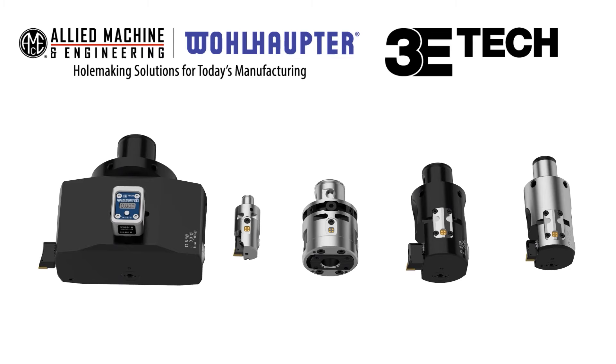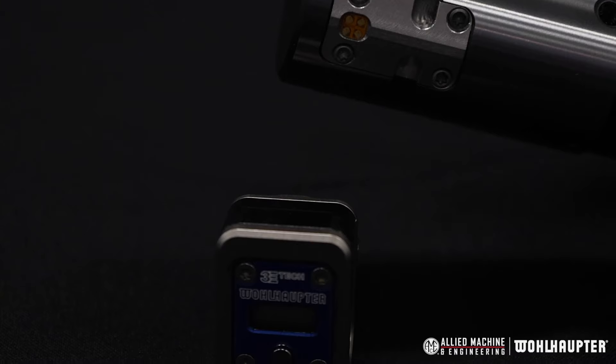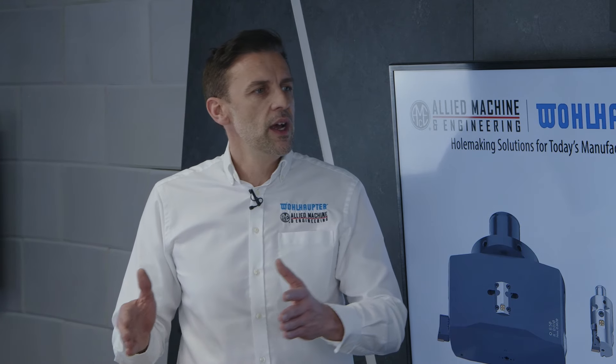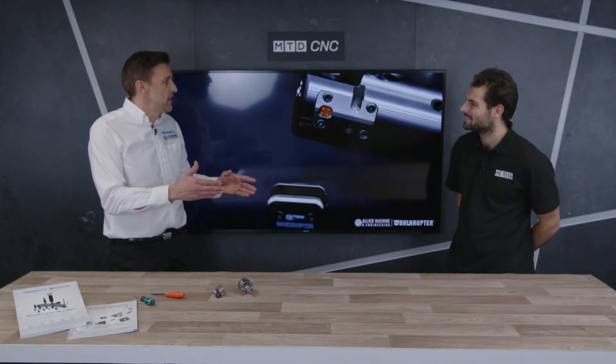That's why you need to make sure you're setting the boring bar correctly. Why are boring bars adjustable? As the diameter gets smaller, tolerances get tighter, so you cannot just use a regular presetter to get your cutting edges to the right diameter — there's always a difference between the presetter and the machine. You need adjustability when making your first test cut.